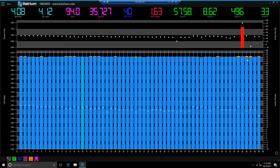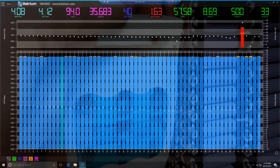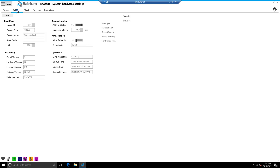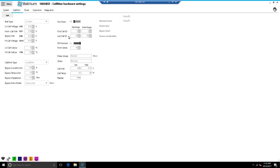Now we need to configure this to show just these last cells - from 45 to 59 - and hide the other 47 cells that are no longer actually charging. It's only these ones here that are charging. Go back to Menu > Hardware > Cellmon. The last cell ID is 59.